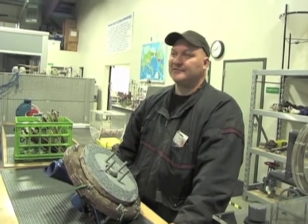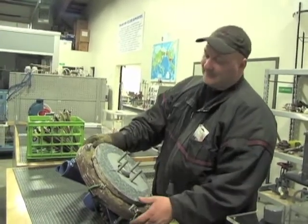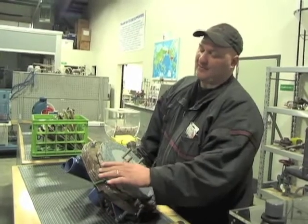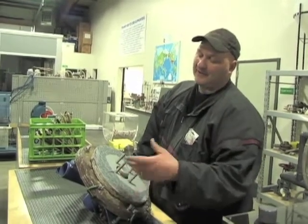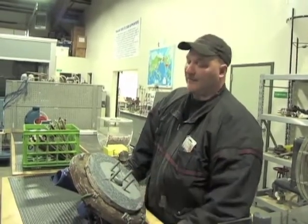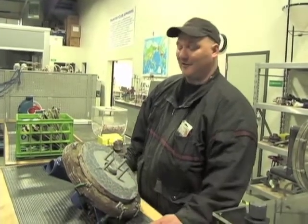In total actual dollars, maybe there's $300 in actual materials, and then maybe a couple hundred dollars in hours — about 40 hours labor. If you're talking minimum wage, you're talking another couple hundred dollars. This little unit here was wound with about 80 turns. We did the math and calculated the size of the coils needed versus the magnetic flux from the magnets, and we calculated this to produce about 1,000 to 1,500 watts. So far they've been producing right around 1,100 watts — right on spot.